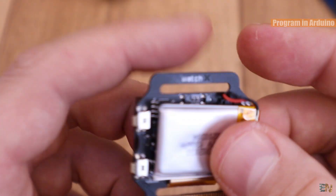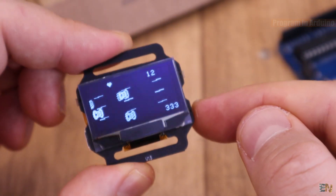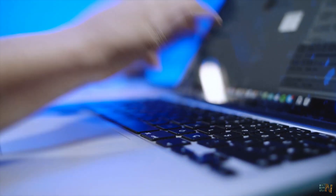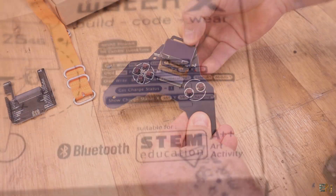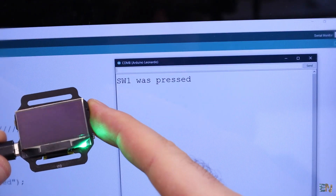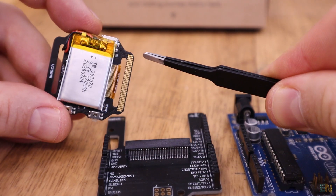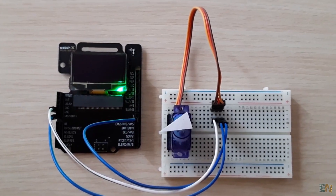It also has a game included for avoiding cars — enter that and play it with the push buttons. You can also download and install the mBlock extension and program this PCB using blocks instead of lines of code, which is recommended for kids but not only. So if you want to start learning Arduino, this is a very good choice since it is compatible with the Arduino Leonardo board. You can read inputs and control outputs and you have everything on the board ready to control and learn. You can always connect it to other parts such as a small robot, the joystick PCB or your own PCB.